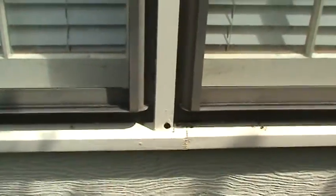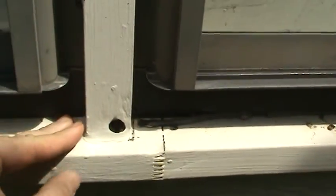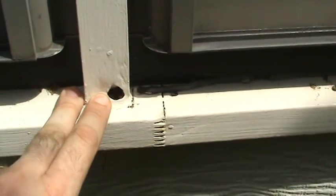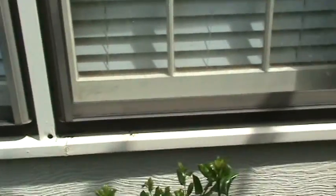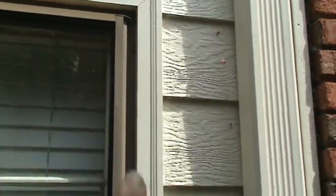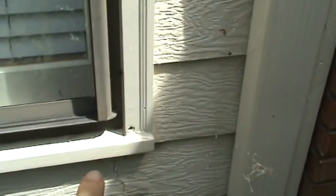The last painters here caused this rot — the homeowner said after their pressure washing there was nothing but water inside the house and they had to repaint a room. We're at the basement right-side corner. This piece, before I touched it the other day, looked good — put your finger right through it. You can see the face looks solid but it's wrinkling. It's all rotted away. The nose is the same: rotted mold, rotted center. The water comes down because the corner flashing is too short — it should extend three-quarters to an inch and a half beyond the edge of the brick mold, but it's cut inside, so water gets behind it and rots the brick mold and the siding.